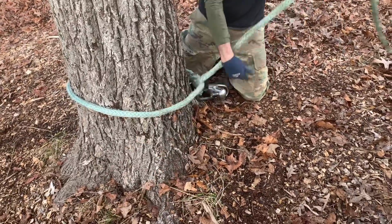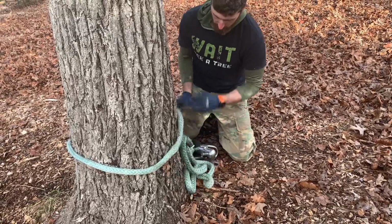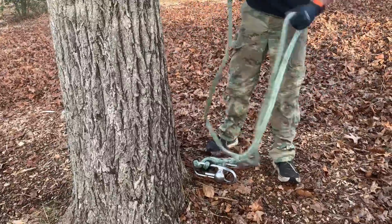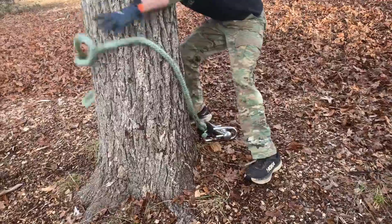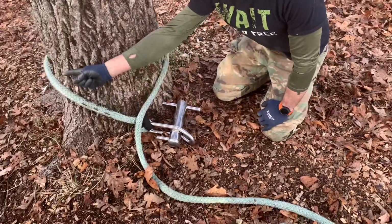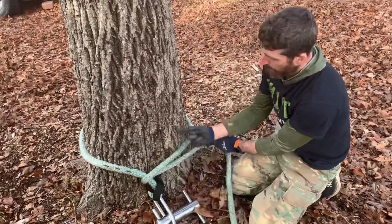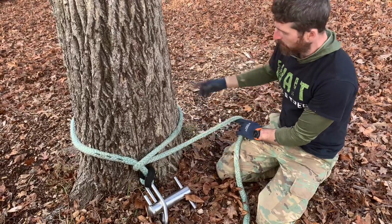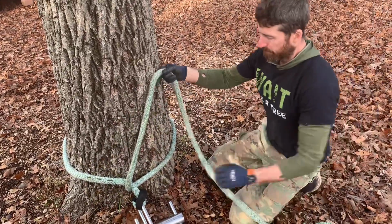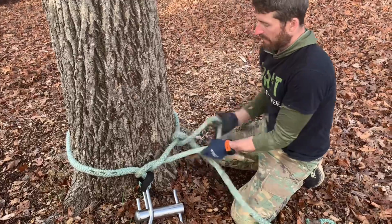Let me demonstrate if I were to walk this from the other side, and this is very important, because there's multiple ways to tie a knot. What if I had brought my sling around from this side? Well, should I still wrap that way? No. I need to wrap back the way I came. So either go over and come under and start wrapping up, or go under your Porta-wrap, your throat there, and then start wrapping. But again, you're still going to wrap opposite the way that you came from, okay?